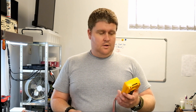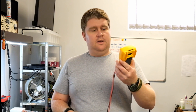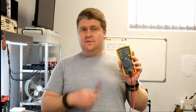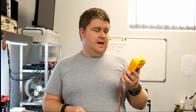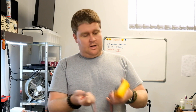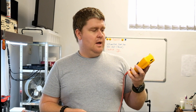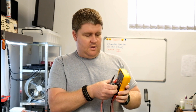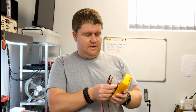In conclusion, the Fluke 113 is a meter I use a lot in the field. I like the simplicity of the all-in-one check mode where it handles voltage, continuity, and diode all in one range — really brilliant. It's nice to hold and easy to operate with one hand using just your thumb, pretty much the same as the Fluke 117 that I own. The only difference is this one is a little bit less full-featured than the 117. Thanks for watching, and until next time, take care.